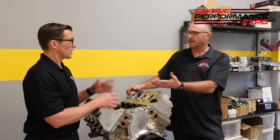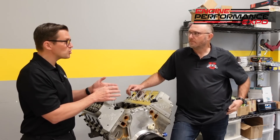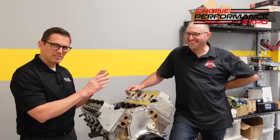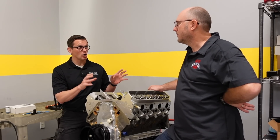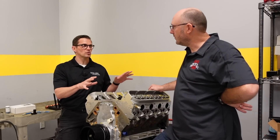So we did an oil analysis, and it looked perfect. Fuel dilution was spot on once we had the right fuel, everything dialed in. Very little wear — everything was actually mint. We obviously got the fuel right, got the viscosity right, all the parts are correct. It's running good, made 1,300 horsepower.